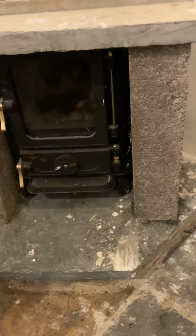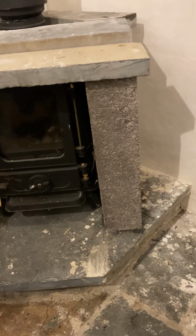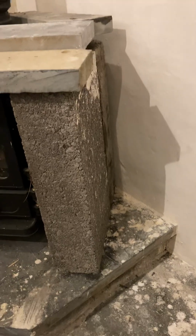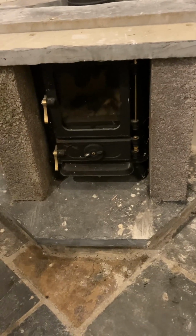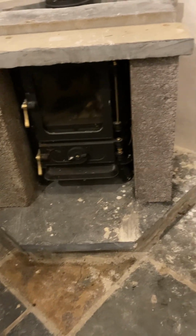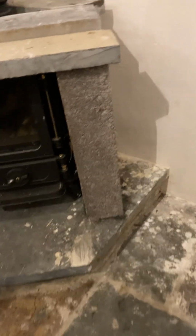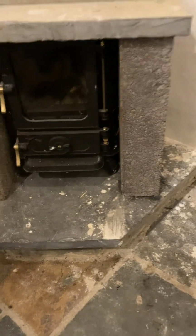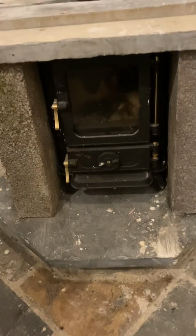And then right before I actually start packing the cob onto this thing, I will probably slather the faces after they already have the stainless steel masonry screws in them. I'll also slather the entire surface with a slurry of either hydraulic lime or possibly cement that will help the cob to really bond to the cement blocks, so that they're all one contiguous mass that will hopefully move together and expand together at the same rate.